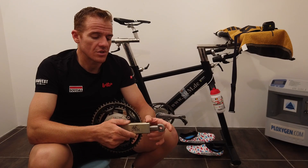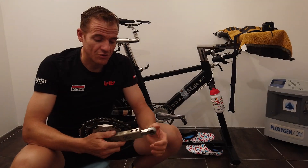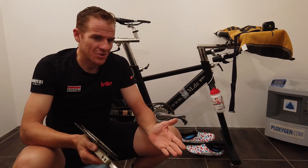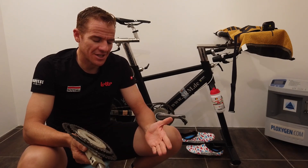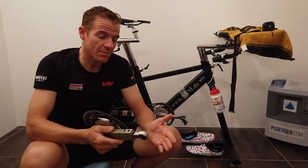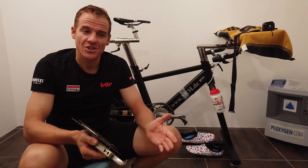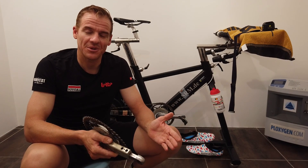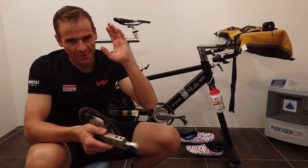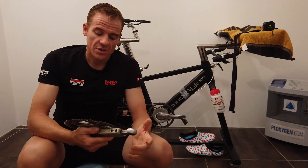You would do that with zero weight, then work out the difference, do it on both sides to work out your slope, then put that into the power control and it'll work out your power. I used longer cranks than normal - I used to use 180mm cranks. With the calculation of five kilos multiplied by gravity 9.81, multiplied by your crank length divided by one thousand equalling the amount of torque, just having five kilos on a longer crank would automatically equal more torque. That's how you used to calculate your slope.